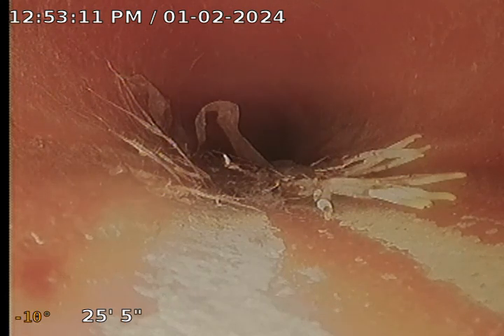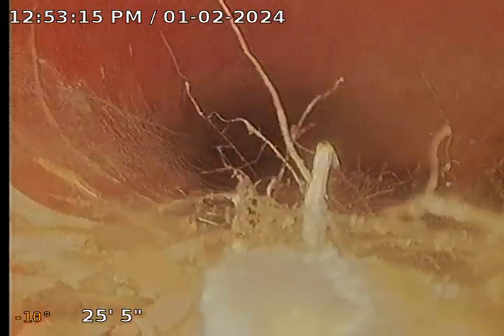It's going to need hydro jetting and probably a sewer liner as well. I'll track this exact location for you, but I'm pretty sure it's where the grass area is — looks like new sod. They probably pulled out a tree, but the tree already did its damage. If you have any questions, feel free to call me anytime. Goodbye for now.